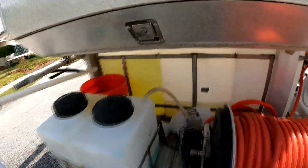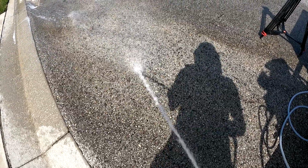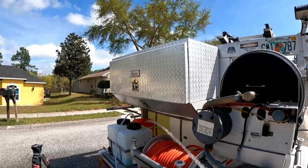Okay, you stick your tube in the fresh water. It just kicked in, so watch what happens. There's not much soap, but just enough to mess up your injector if it sits in there long enough. Got to go through the 200 feet of hose first. There it is. See that soap that just come out of there? Alright, you got to always rinse that stuff out. Okay? And always soak it in a fresh bucket of water, and that's what that is right there.